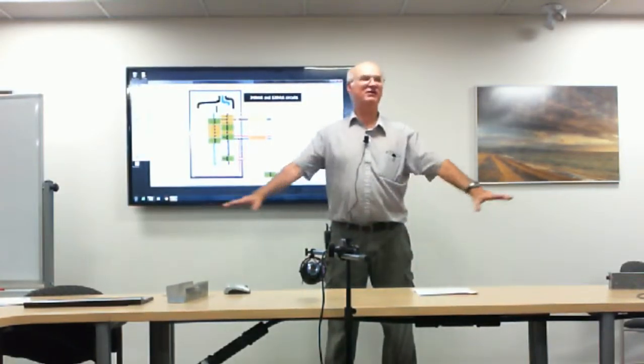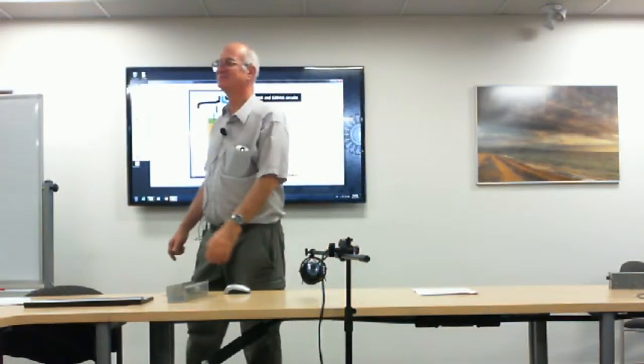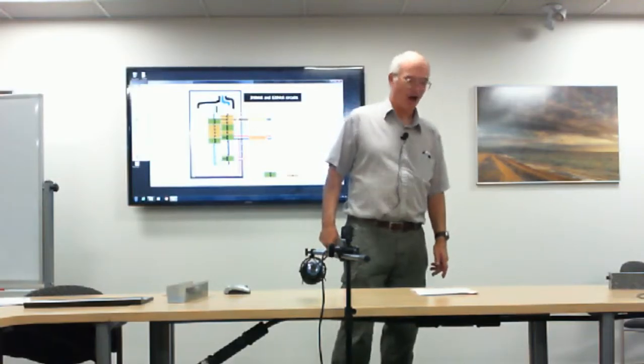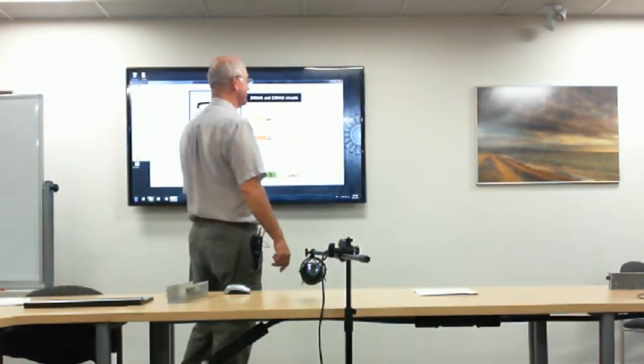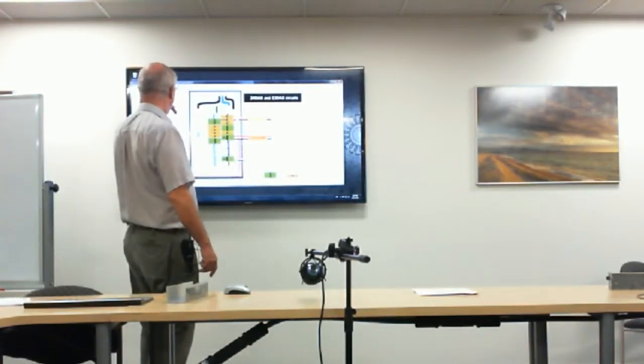The recommendation is: if you're working with tube gear, make certain you're not on a basement floor. If you are on a basement floor, put down a rubber mat. You can buy a ground fault detector for a two-wire system, and you can actually buy a breaker that goes in your panel so that whole circuit has ground fault protection. GFI is your other protection. The other way is an isolation transformer — a one-to-one transformer that puts no direct connection to the system. You can still get a good poke out of it, but not one that's going to put you in a box.